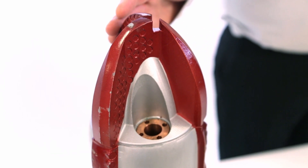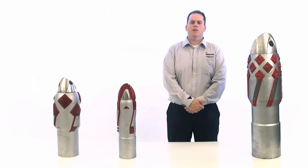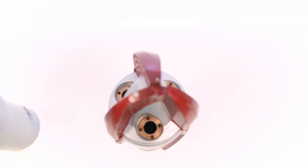This technology combines a premium reamer shoe with a casing bit for casing and liner reaming applications. The long, tapered, and bladed concentric nose, along with the long length of the gauges, help to avoid side tracking in soft formations.